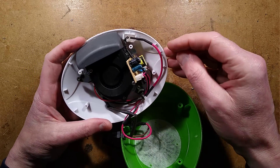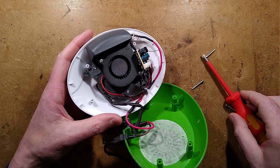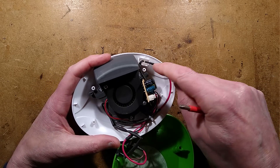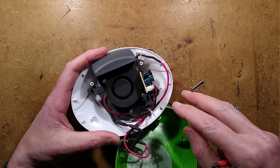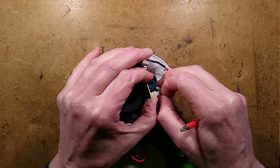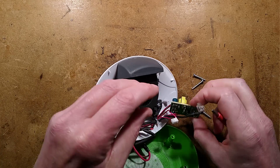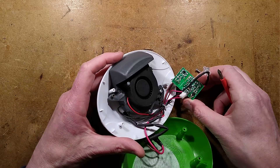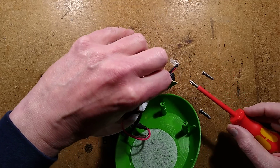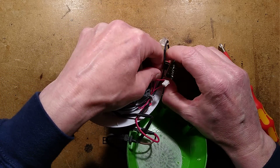There is the little neon indicator. I wonder if the resistor flashed over in that - I'm not sure if there's a diode as well. Let's take everything out and see if we can find a sooty scorch mark. The LED indicator was run directly from the mains - it wasn't run from the low voltage power supply used for the fans, which is strange. Let's unplug this, get the board out, and short the capacitor just in case of any zappy surprises. Nothing - that's fine, finger test confirms it.